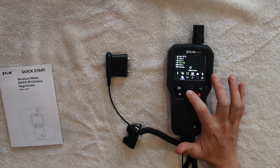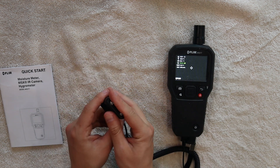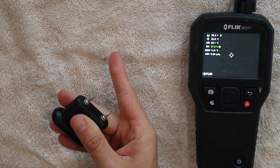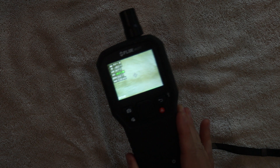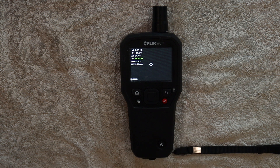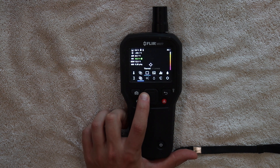If you go into image mode and over into the digital camera, all of the psychrometric data is going to be at the top. If I push it, you can see it is changing in the top left of that screen. The digital camera is a 2MP with a 70.5 degree by 75 degree field of view. The display type is a QVGA 320x240 pixel 2.8-inch color TFT graphical display. The field of view width and height is 57 degrees by 44 degrees. The image modes include thermal, visual, and MSX.